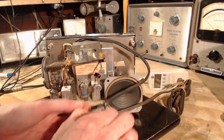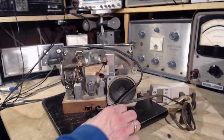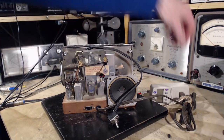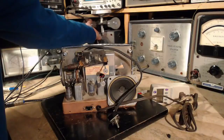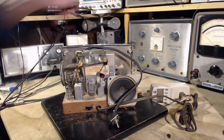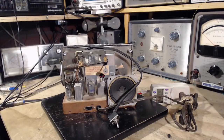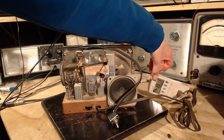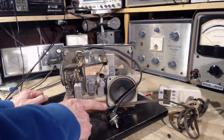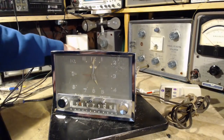Let's get it going and find out if the clock works. The switch currently is off. First thing is to find out if off is really off — it's only got two poles, it's going to work. So when I throw the switch, nothing should happen. These lights should not come on — in fact I've got to take out this bulb, which forces all the power reaching the radio through this light. Keep your eye on this — here we go. No bulb light. 123 volts, full voltage here, so the switch is definitely open. And the clock is running — oh my gosh! An awful lot of these the clock won't run.